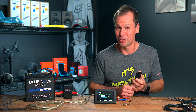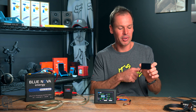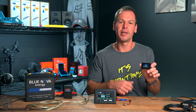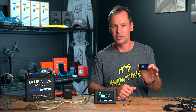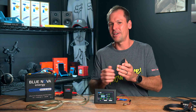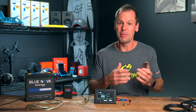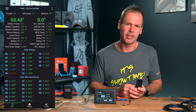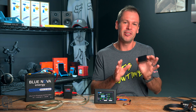Here's another issue I found with the smaller screen — it's kind of opposite to the problem with the bigger screen. The small screen has been asleep most of the time during the video. When you wake it up, it wakes up fine, and in the BMS app it's set to go to sleep after about 20 to 30 seconds, which it does as expected. However, if in the app you set the display to always on, it still goes to sleep — it doesn't actually stay always on, whereas the larger display won't go to sleep and is happy to stay always on. This will probably be fixed in a firmware or software update. If you know any different, please let us know in the comments.